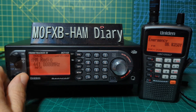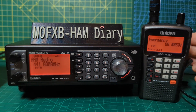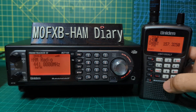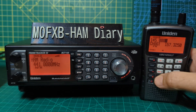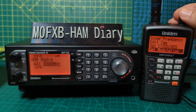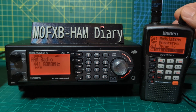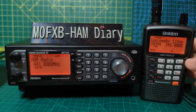I do often just type in a frequency directly. Press Hold, type the frequency, click Enter and it gives you the option to save. You press Enter and you can tag it — give it a name. You can also change the frequency, set CTCSS, set the modulation to AM or FM, set it as a priority, and there's a delay setting too. There are loads of settings there.